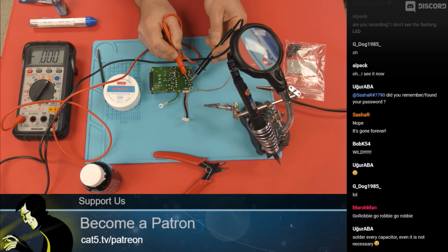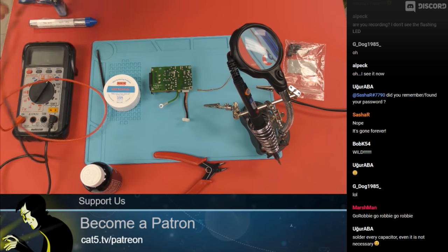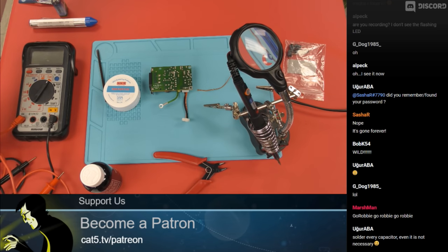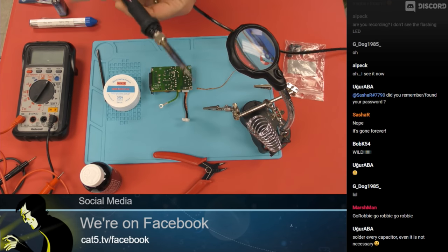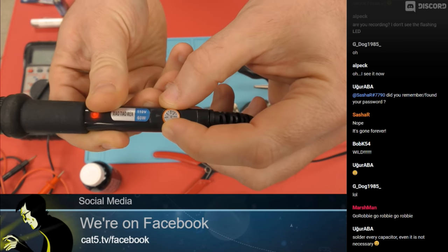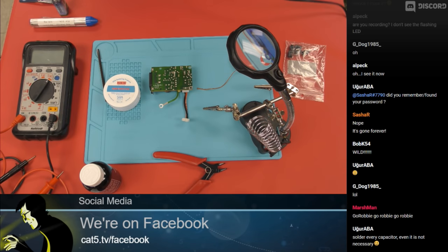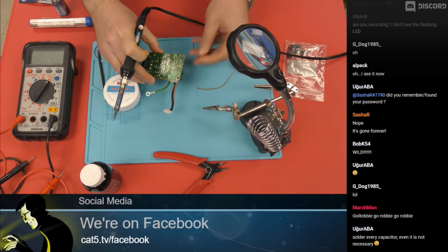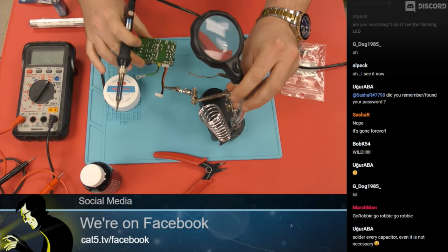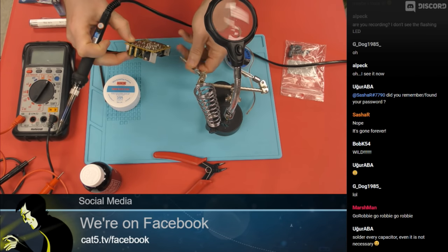At 10 volts, you're probably not going to get a shock from that anyways, and you could probably short-circuit it and it will discharge safely. You may want to look on YouTube — there are better people than me to teach you that. I need to make sure my soldering iron is reasonably hot — a little bit hotter than when I'm soldering, especially because I'm going to be using a desoldering wick in order to remove this solder.